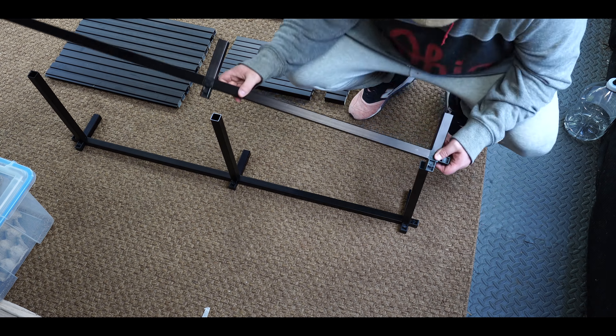Since this is the first rack I've built like this, I wanted to make sure my measurements were going to work, so it's always safe to do a little double-check on the measurement — and we're good. Now we're going to essentially build the first row. I'm working on the back side first, using three of the 28 and a quarter inch long pieces for the back and three of the 24 and a quarter inch pieces for the front. The reason the front and back aren't the same height is because of the spacers on the front side for the light shield — I made my spacers three inches, and you have to allow for one more inch for the thickness of the bottom tube of the light shield.